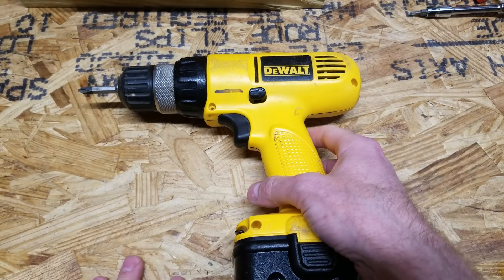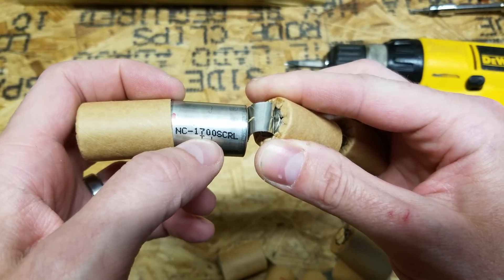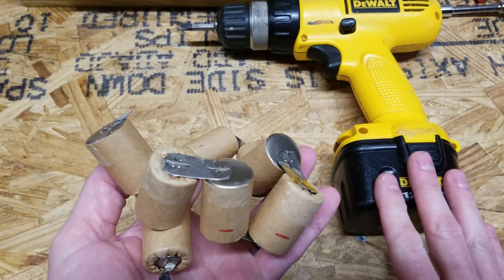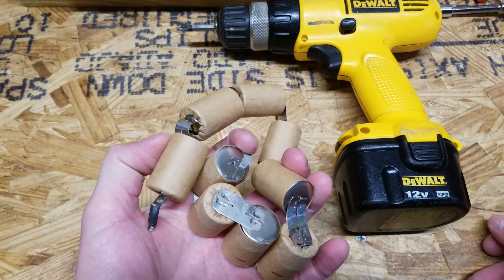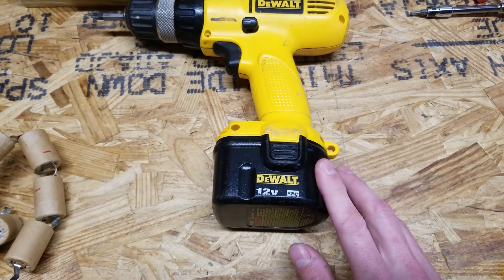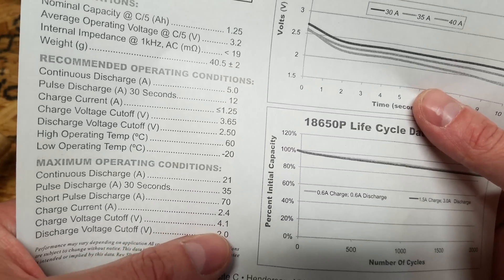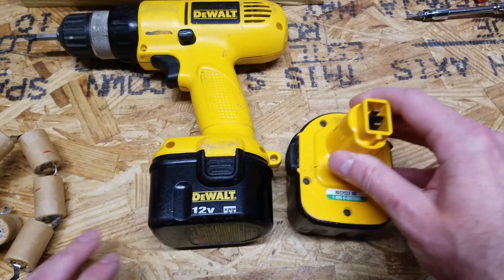While waiting for the glue to set I noted a couple of things. On the old batteries, if you remove the cardboard sleeve there is a model number printed directly on the cell — it says 1700, so I'm assuming these are 1700 milliamp hour cells. My replacement cells are 1350 milliamp hour, which is less, so I'm not expecting the new battery to last as long. However, with how degraded the old ones were, this should still be a substantial improvement. I also want to mention charging — the voltages line up near perfectly with a 12 volt battery pack, and there's a huge tolerance with these cells. The maximum charge is 4.1 volts per cell, though I wouldn't go anywhere near that. Once I confirm this battery works well, I'm going to rebuild the second one as well.